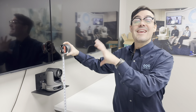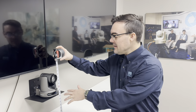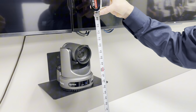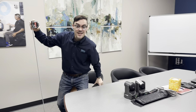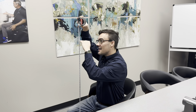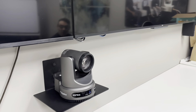In this conference room meeting space where most people will be seated, the PTZ camera comes in at around 51 inches. You want to look at where people are sitting in the space, sit them down, and get an average. When seated, 51 inches puts the camera at eye level. In a stage environment like a church or venue, things get a little different, so let's look at some of the cameras mounted in our venue.